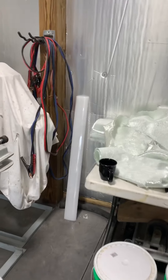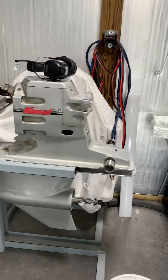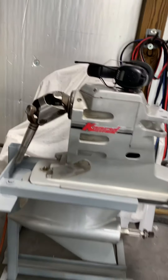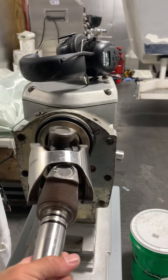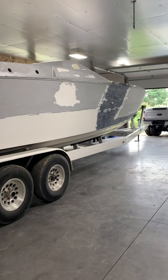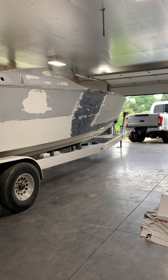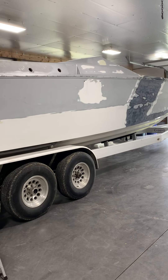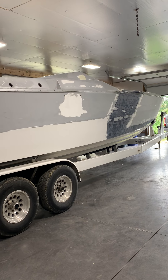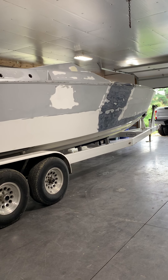As you follow the other videos, this boat has Conrad 540 drives. We thought about going to a number six Mercury, but after talking to Conrad and looking at parts availability, it's a pretty stout drive — big U-joints, big gears. We've taken them apart and checked them. These straight-bottom top guns with number sixes seem to porpoise a lot. With Mercury 575s bone stock and these Conrads, this boat went 80 miles an hour — some days 79.5, some days 81.5. We'll call it dead-nuts 80.